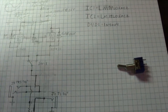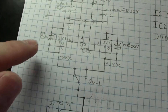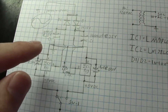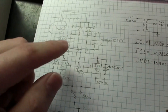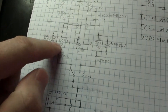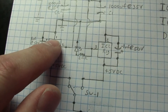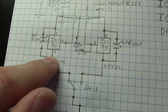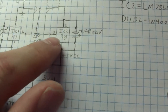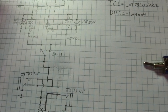That's really just one section of a power supply — the positive half. The negative half is identical but everything's reversed polarity-wise. The capacitors are reverse polarity because they're electrolytic and they will explode if you get the polarity backwards. So basically this one is always getting positive, this one is always getting negative — everything has to be kind of backwards. The regulator also has a different pin-out: for the negative regulator, pin 1 is ground, pin 2 is input, pin 3 is output. For the positive regulator, pin 2 is ground, pin 3 is input, pin 1 is output.